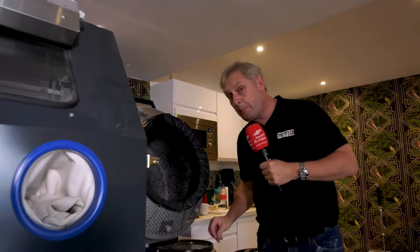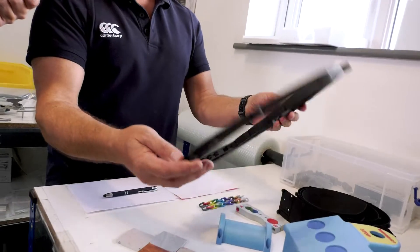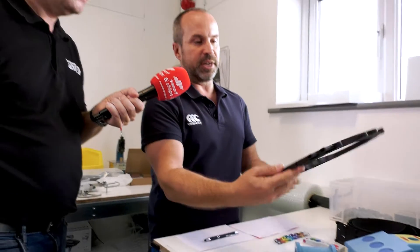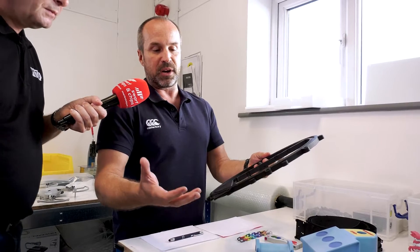Let's go and look at some of the components they make - there is no limit to your imagination. FDM - what does that stand for? Fused Deposition Modelling. Basic 3D printing - melting a sausage of nylon and sticking it to stuff. But you've moved on massively since then, using the PA-12: super rigid, super flexible. This one is a good demonstration of how we can include complexity. We've got a really solid, really rigid part, but we've got a threaded connector printed in situ that's captive, can't ever escape, and there's not really any other way you could do that. We've got galleries running through it, hex recesses directly for nuts to be embedded in it - it's all about reducing the amount of post work by building the complexity in at print time.